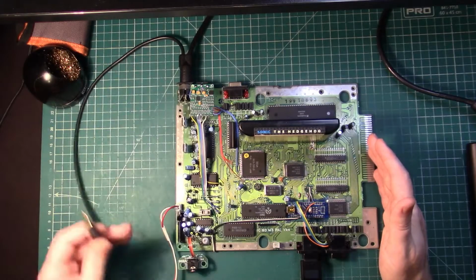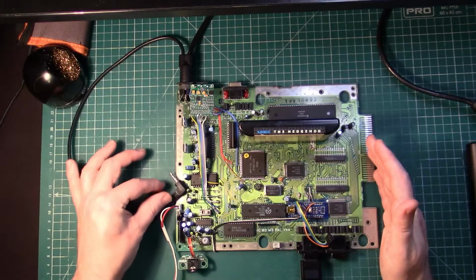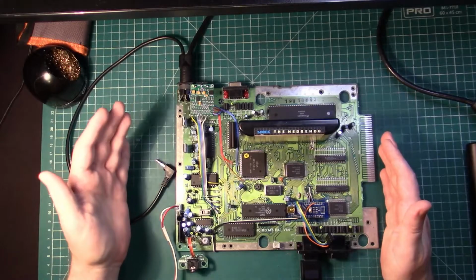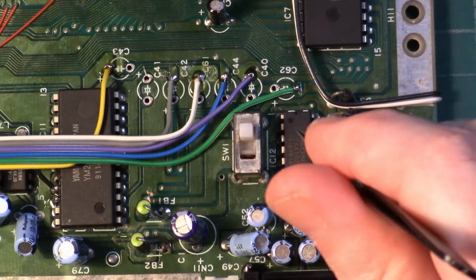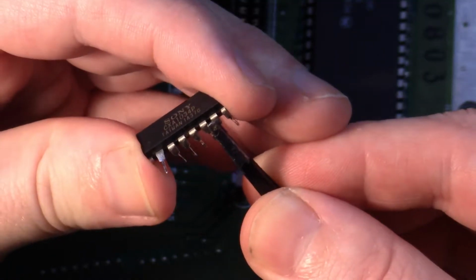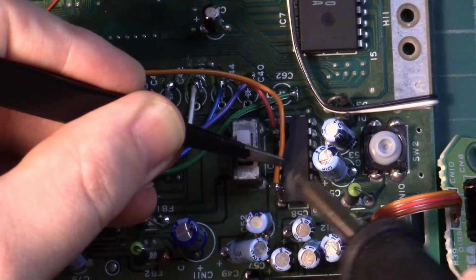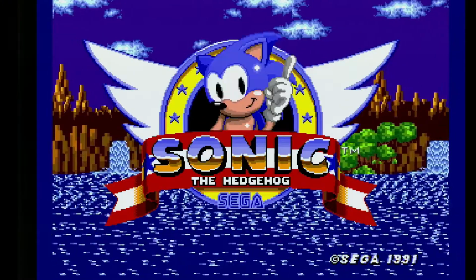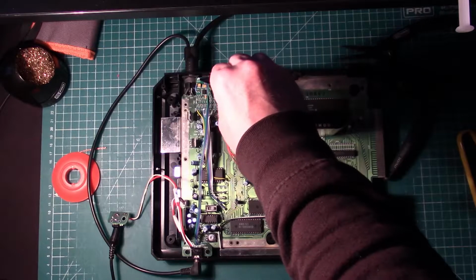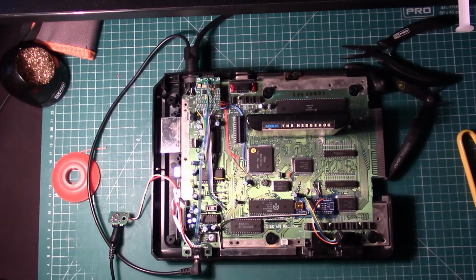To fix this, we could pull audio from the stereo left and right channels on the triple bypass board itself. This does mean our volume slider at the front won't be functional. So after experiments with connecting the audio to the Sony CXA 1034p stereo amp, with less than desirable results, I decided to do just that and connect the front stereo plug to the output at the rear of the triple bypass board.